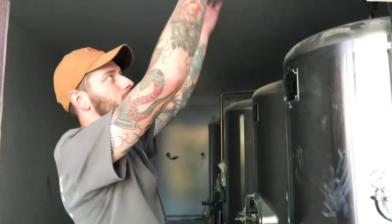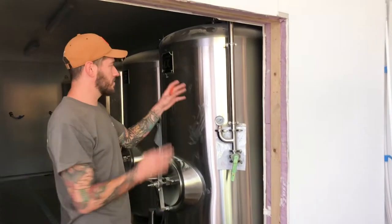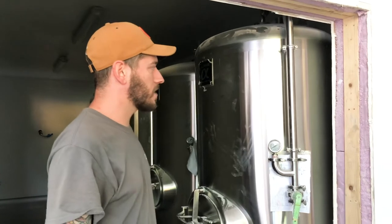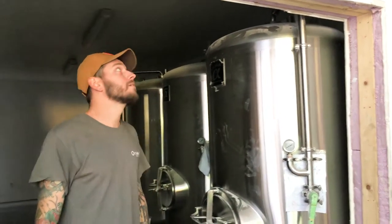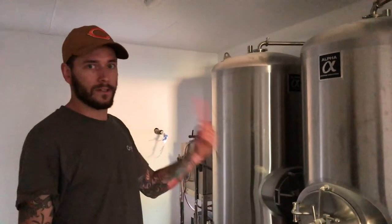So yeah, it's about a nine-inch thick wall. There's batt insulation between the two-by-four studs, two inches of foam on both sides, five-eighths of drywall, and FRP all the way around. We've got vapor-tight lights that we don't have to worry about blowing up and getting everywhere. These are the holding tanks for all the beers. Once John's done and the beer's all fermented, they'll come over to the holding tanks — basically right where they'll serve them from, for the majority of the beer. And then the other specialty beers and stuff will come out of smaller cans.